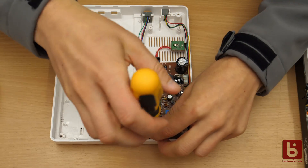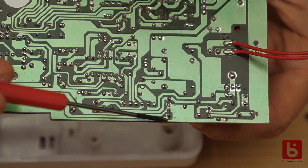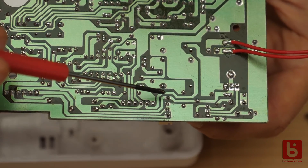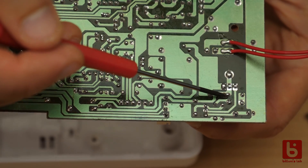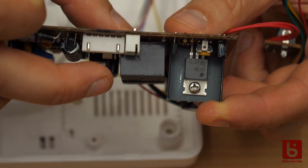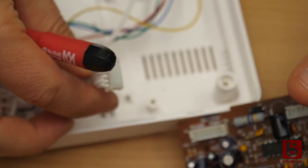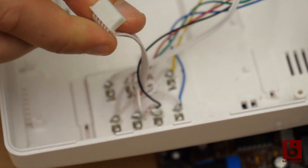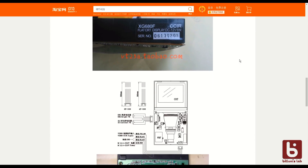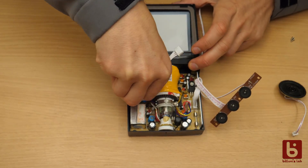Let's take a look at the intercom board video and power connector to determine the pins. When we look at the traces we can immediately see the two center pins are connected to the ground plane. This outer pin is connected to a huge transistor which seems to be used as a power switch for the screen. And this pin should be the video signal which goes to a connector coming directly from the wall. Or you simply search the part number and get the needed description from the internet, like I did before trying to impress you with the last 20 seconds there.